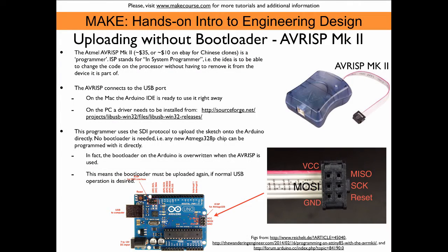If we want to upload a sketch without using the bootloader and USB interface, we still need something that communicates with the chip and connects to the computer. What Atmel sells is called the AVR-ISP-MK2. ISP stands for In-System Programmer. The Arduino board has pin headers on it — you may have wondered what they are for. They are unmarked; it just says ICSP in very small print. This is the port where the AVR-ISP-MK2 device connects.